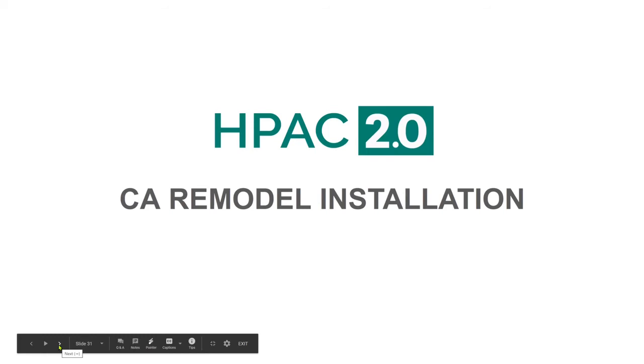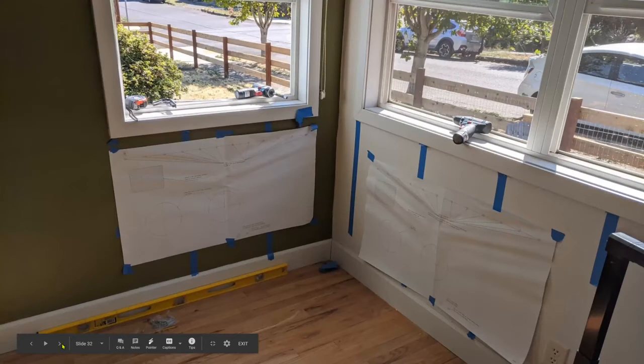Here you can see the step one is you mount the mounting template on the wall so you know where to drill your holes and where to put your bracket. The next thing you do is drill your holes. Here you can see that drilled from the outside. In this application, they used 8-inch holes. You can use 6-inch holes or you can use 8-inch holes. The performance is actually better at 8-inch holes. The numbers I showed you before are for 6-inch holes. Performance for 8-inch holes is about 6% better.